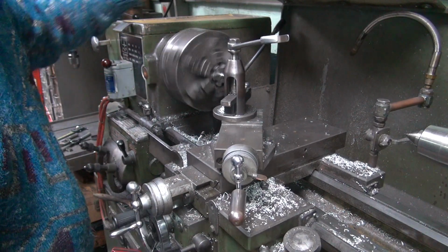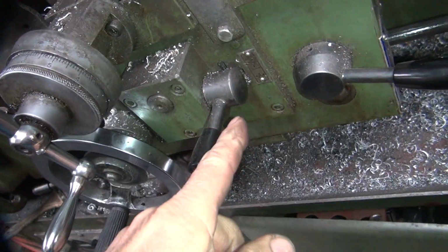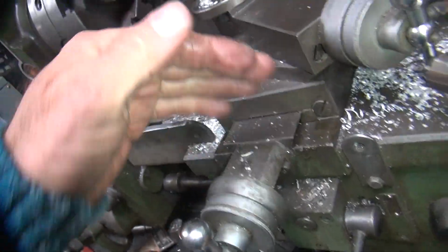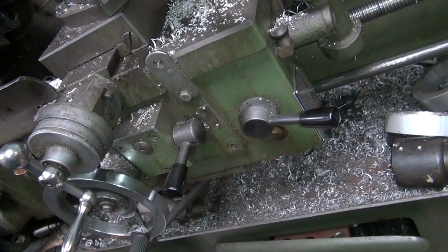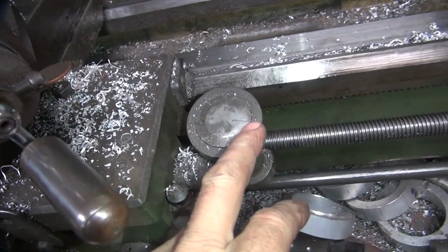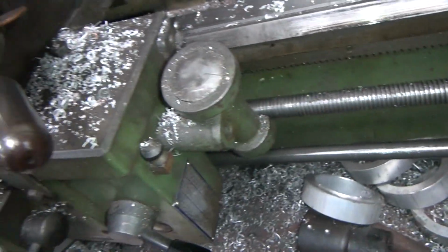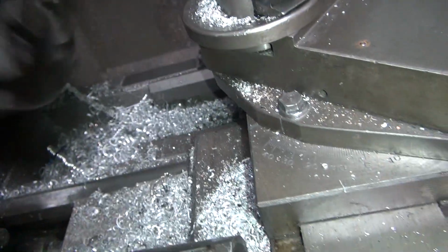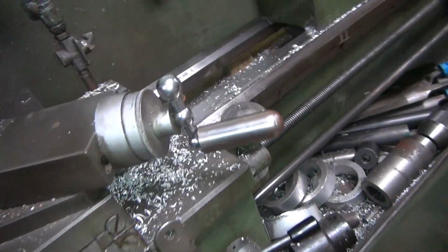Number one. Okay. So when we had this partially engaged to make this all feed, it wasn't engaged enough to feed it, but it was engaged enough to lock the system up. So now this is turning. The screw is turning here slowly, if you see it. And the dial stays on this number one. But the machine is moving, see it? It's about 24 threads per inch at this point.